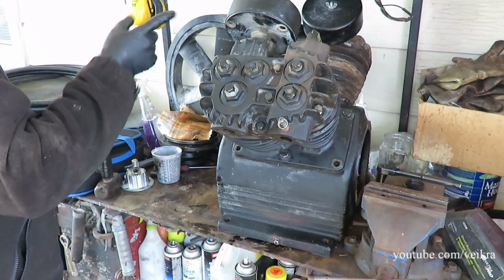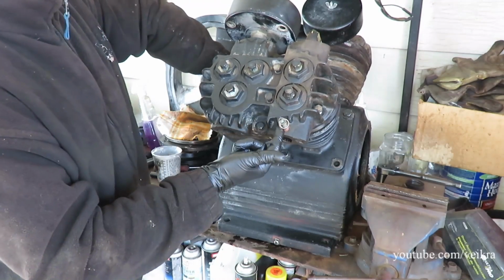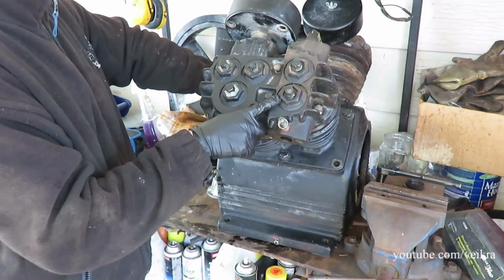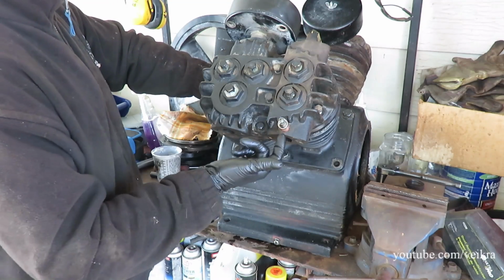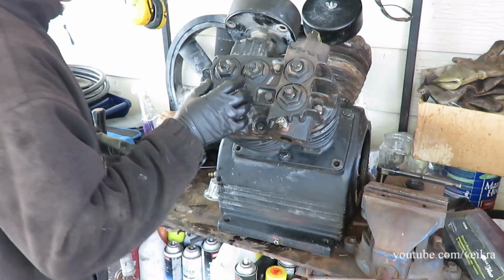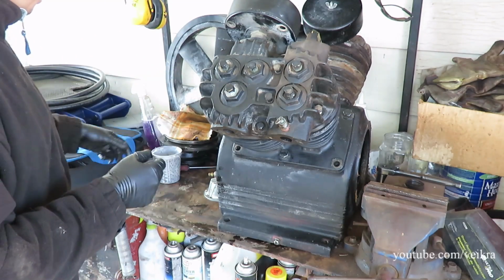It's one of the valves, which is what I first picked up on that compressor. It was bleeding air through here, and usually what it means is a bad input valve on the high side. So when this one breaks, both pistons are pretty much working one against the other, and air comes out of this, so it renders the whole head pretty much junk and not pumping air. So all the load transfers to the other pump, the other side, and yeah, not a good thing.